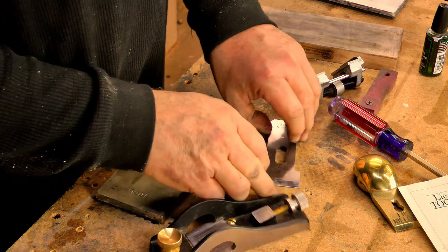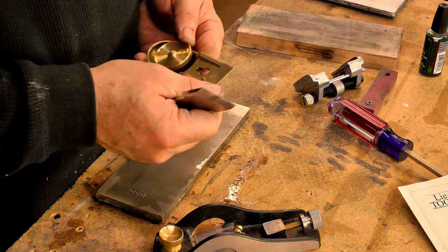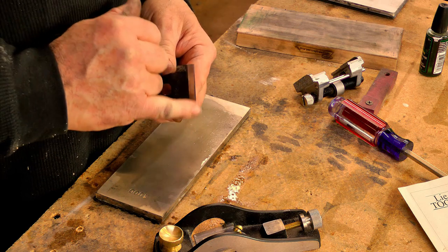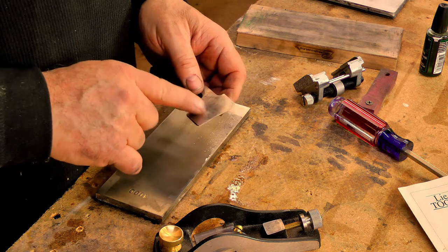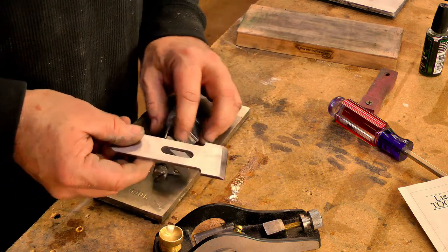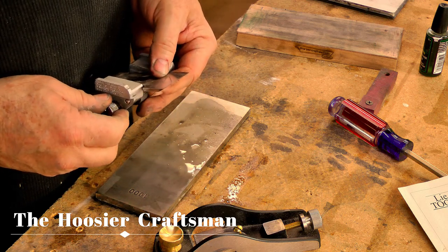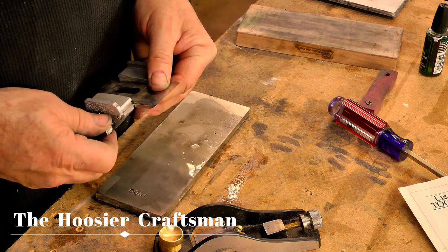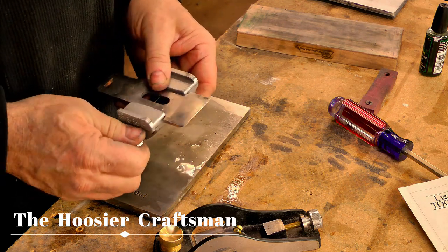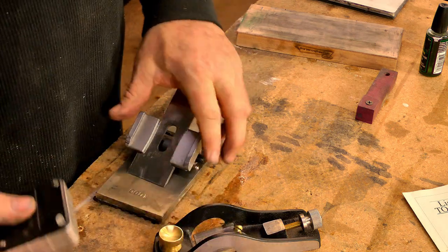Now I'm going to work on the blade. On the lever cap I'm not going to bother touching it — it came this way and works fine. I'm going to put a 40 degree angle on the front bevel, and on the back I'm going to put just a little chamfer. I'm going to use my honing guide. Now this can be quite tricky to set up — it only goes in so far, so it's not really an accurate 40 degrees. I believe it's right around 30 degrees. It can be quite tedious to get in there. Let me get my angle reader out and see what we're at.